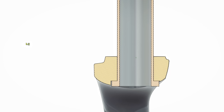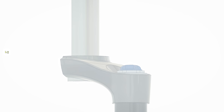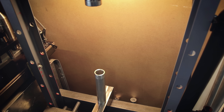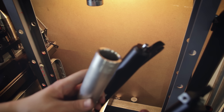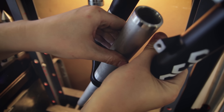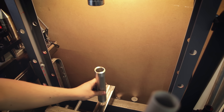On most modern suspension forks the steerer is a separate part that's just pressed into the crown using a friction fit. After doing some research I was fairly confident I could press out the old steerer and press in a custom one made to the exact dimensions I need. You do need a hydraulic press for this — I've got a cheapo 20-ton press, but you're probably good with about 10 tons. I'll link a video in the description from someone with more experience with this process.